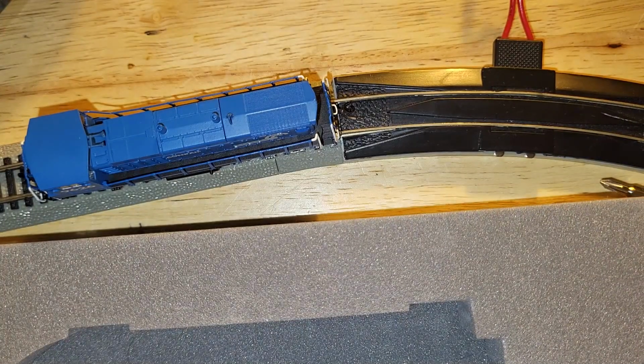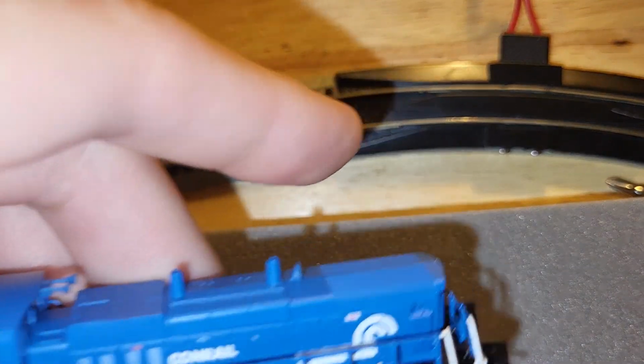So, just like that, by simply going into address 8, reprogramming this, like many have found, I was able to get this working. It appears though it did have a contact problem, which I resolved by simply moving the decoder a few inches, and that fixed everything. And so with that, I now have a fully repaired locomotive.